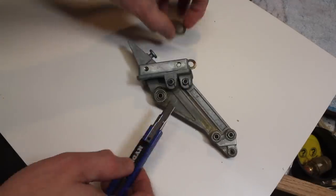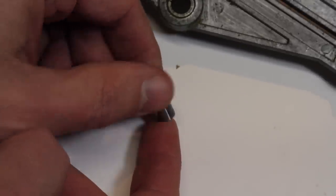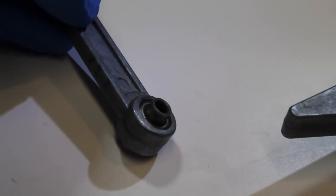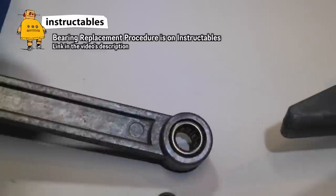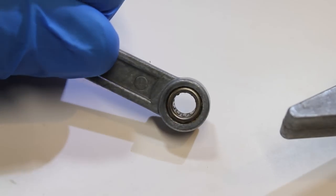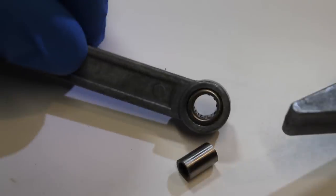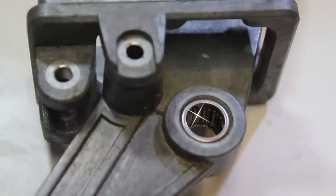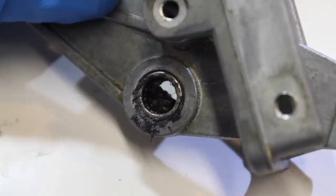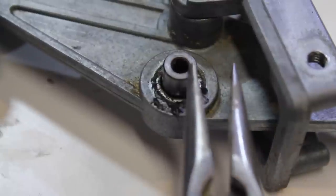The process is the same for all of these bearings — I won't show them all on camera. Just take things apart, clean them, store the parts, and then expose this metal sleeve. This is hardened steel — it should be smooth with no vertical dents. If there are dents, you'll have to replace the bearing and the sleeve. Mine were all okay. Clean the bearings using various methods: pipe cleaner, Q-tip, and a Q-tip with a cloth wrapped around it. Then use the synthetic grease — really get it in there and scrub it into those bearings. Then put them back. That's the secret.